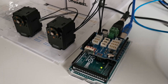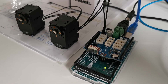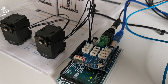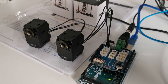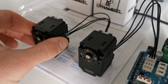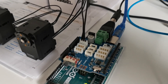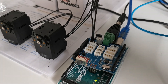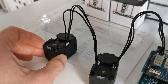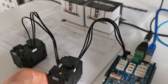Hello, today I'm going to give you a short explanation of how to work with more than one Dynamixel X-series servo with Arduino and the Dynamixel shield from Robotis. Each servo comes from the factory with identifier one, so if you connect all of them without configuring the ID you get a conflict. Before chaining servos using TTL or RS-485 cable, you need to update the ID for each of them.